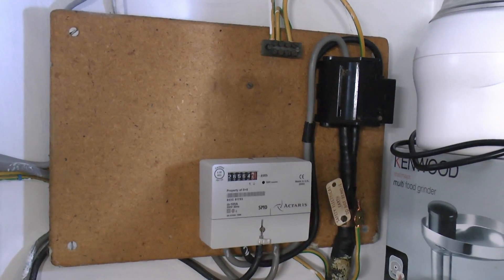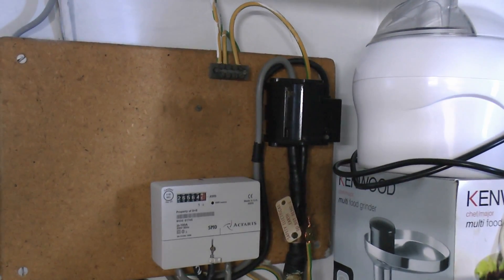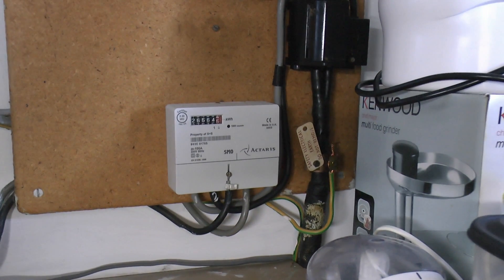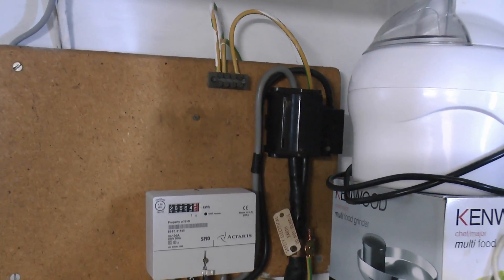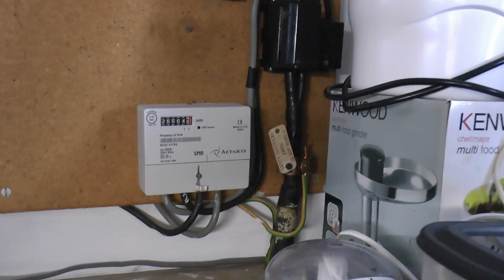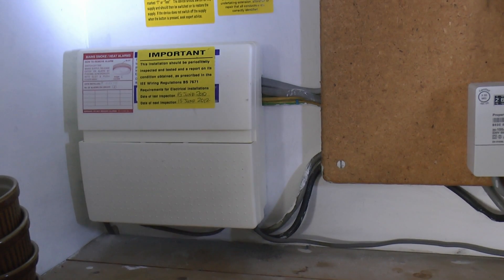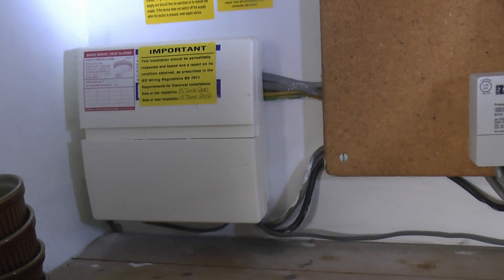As is often the case with these things, this is stuck up in a high cupboard in a fairly inconvenient place. Here we are in the cupboard and you can see on the right there we've got the incoming cable from the bottom — this is a fairly old one, probably 30-40 years old. The supplier's cut-out is at the top there with a fuse, and the two wires go to the electricity meter in the middle, which is a fairly modern meter with a mechanical register. This installation has a rather odd earthing arrangement, with a wire coming out of the cut-out implying it's a TN-CS variety, and another attached to the covering of the cable. The consumer unit is over to one side and is a plastic unit. The label shows the last inspection was in 2010 with a recommendation for another two years later — and of course it's four years after that.